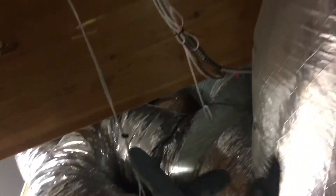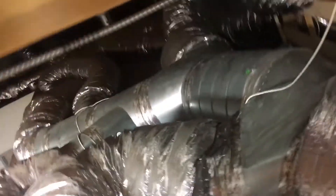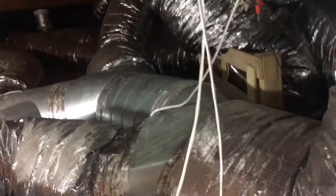I am going to fix this. I'm going to try to make it slightly sloped and get rid of this massive kink, because the smallest diameter is between this point right here — see how it's sloped over — and this point right there. I need to open this up, I need large sweeps. Just like copper fittings, you have the long sweep versus the hard 90s — we're going to try to do long sweeps going in here to increase the airflow.